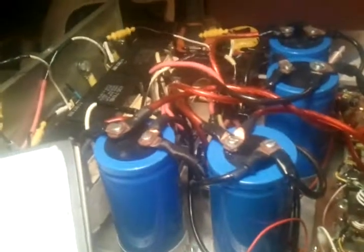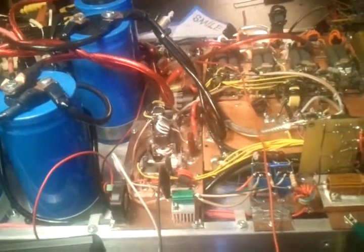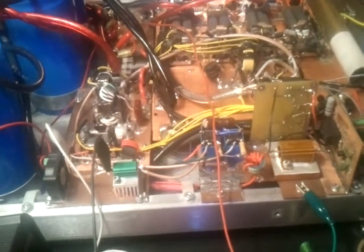With this high-low-medium design that I've done here, I also can add even a third resistor if I wish, and add an extra switch that will send ground to both relays at the same time. And I might possibly do that. We'll see how the 2-pill section reacts all by itself on a big 200 amp supply, because it ain't gonna put a big load on it. So it's the only thing I'm worried about, the voltage not dropping good enough. If it doesn't, I might have to add that last resistor, probably 100 ohm or 150 ohm, and back that thing down real good so the fella can run just a 2-pill section on high voltage.